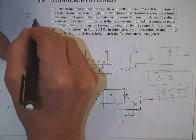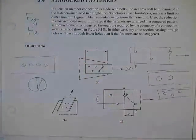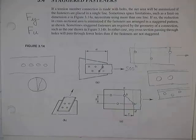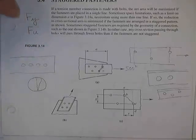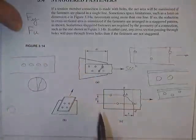And the reason is, what is this? See, we're using, I don't remember. What are we using in this calculation? F sub u. Very good. We're not using yield. When do we use yield? Where on this angle do we use yield? Gross area, around in the middle of the thing, where it's got a long length and it can be yielding. We don't care if these things yield. We're looking at tearing strength here. How did I get off on that? I remember why, because I need to know which one of these to use.